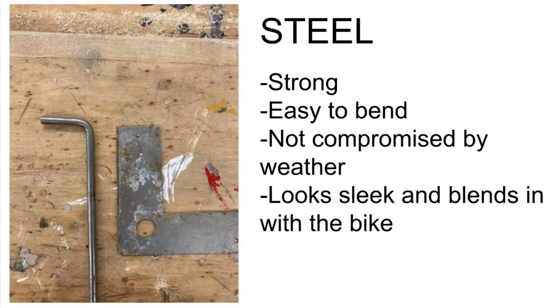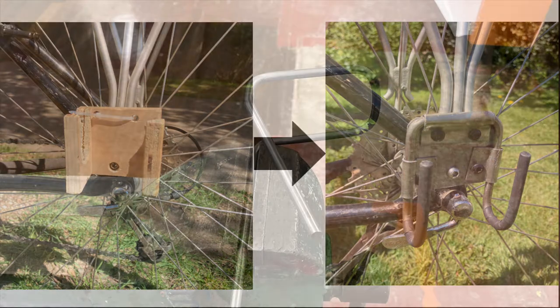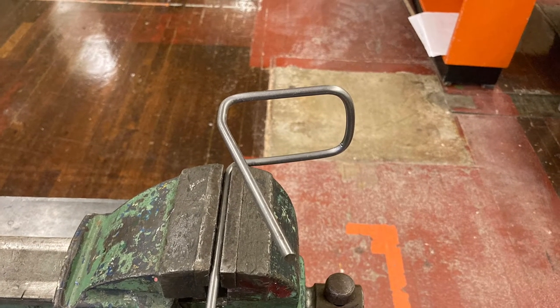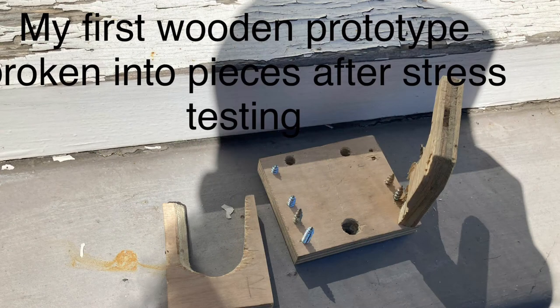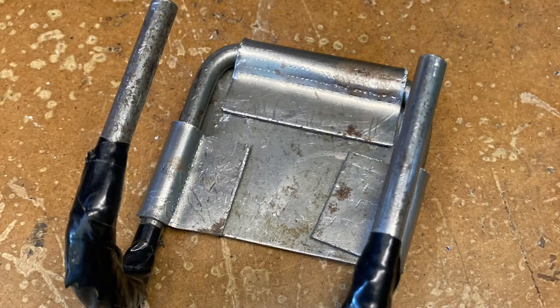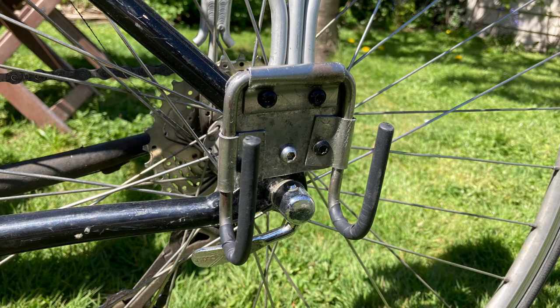From the beginning I knew I wanted to make the finished product out of steel — it would be sleek, durable, and weather resistant. I carried over the mounting bolt design from my wooden prototype but changed the aesthetics completely so it would look much sleeker. The first step was bending the steel rod into a U-shape with two hooks on the end. For the first version I zip tied this hook to a metal plate, but once I tried it the zip ties ended up snapping and the whole thing broke. After this unexpected failure I changed my design so that the weight from drops and bumps would be put directly into the steel plate and bolts instead of zip ties. Mounted to the bike the exact same way as my very first prototype, this one worked flawlessly — it was completely strong and I couldn't break it if I tried.